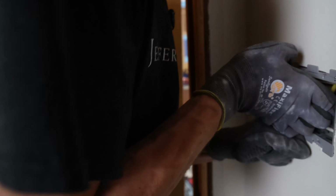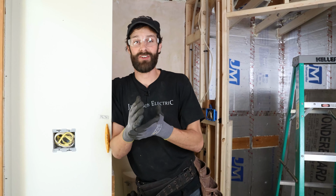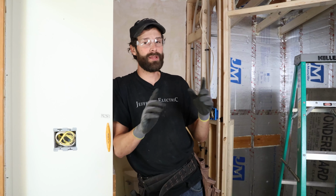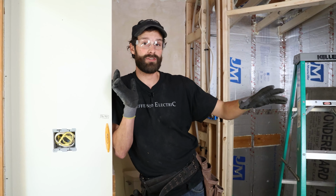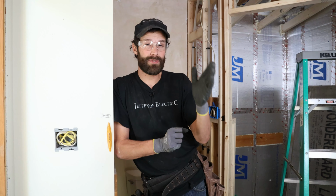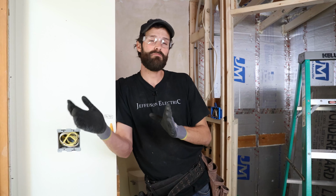Yeah. So this scope of work that we've done, when you're considering both rough in and finish out work, the return trip, permitting excluded, mobilization costs excluded, we're looking at 6 switches across 3 locations, 14 total lights, a total of about $1,500. About 60% of that work is done on the rough in. And 40% on the finish out, maybe a bit less.